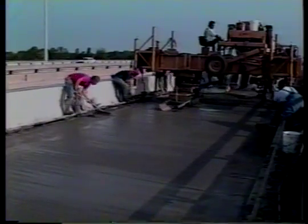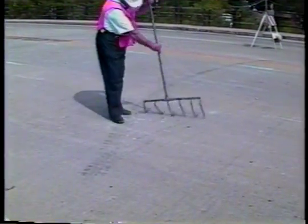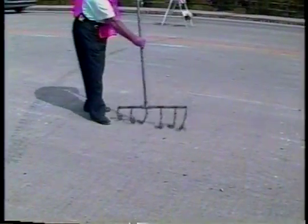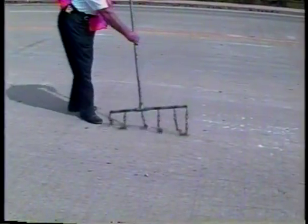Excessive deterioration may indicate that only total replacement would be cost-effective. So a visual survey is the first and most important test, including a close examination underneath. This is especially important if there's been an asphalt overlay. After a visual survey is completed, the deck should be sounded to locate any subsurface delaminations. Extensive delamination may indicate the need for deck replacement.